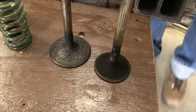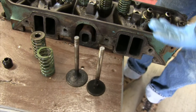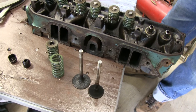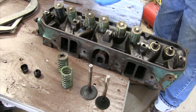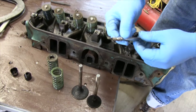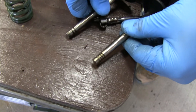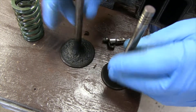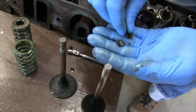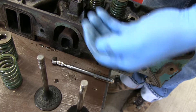These are 906 heads, so this will have the larger exhaust valve — I think they're 181s, I can't remember the numbers. Valves have two different retaining styles: you've got a two groove and a four groove on the stems. So obviously you have keepers that either have two grooves in them or four grooves in them. That's the only thing that's going to be odd with them.